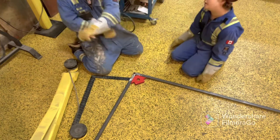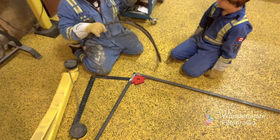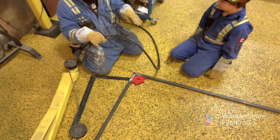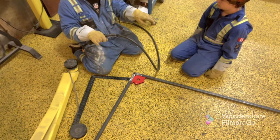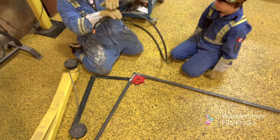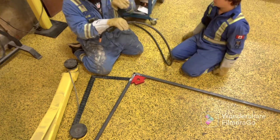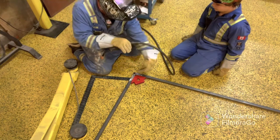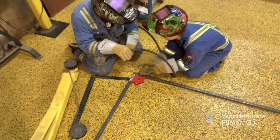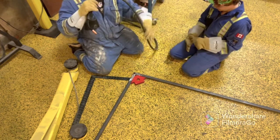So, now, you're going to put one on the inside from there, a little bit. I used twice, like you. They're all little U's. And you're moving this way with them, right? You're not just staying and doing a U. That's what happened over there. We stayed in one spot and it just built up a mountain. So what we want to do is start doing our U's, but you're actually going forward into your weld. You're pushing the weld. You can also pull the weld, but we're going to push, okay? But you're going to do it very slowly, right?